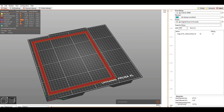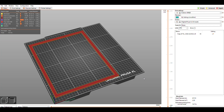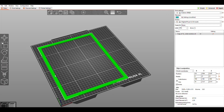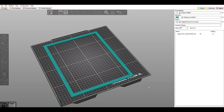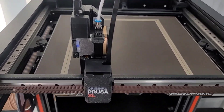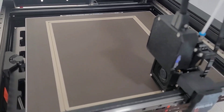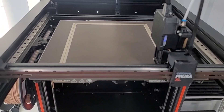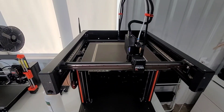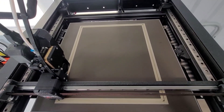I check that the layer height is correct and that the temperatures are still good, and everything does look good. For one final thing I decide to go ahead and center this and make it as square on the bed as I can, just in case it needs a little bit of extra help. I slice it again and I'm ready to try this out. I check back on the first layer and it's looking great — very smooth, the temperature looks right, the bed is heating correctly. I think I just had my settings wrong in PrusaSlicer and that's what caused it to curl off the bed.